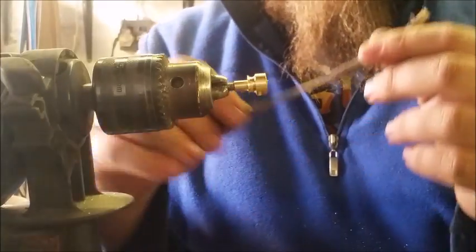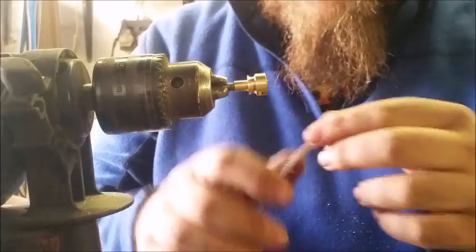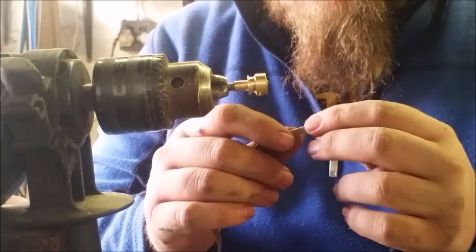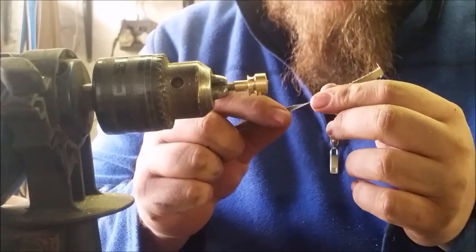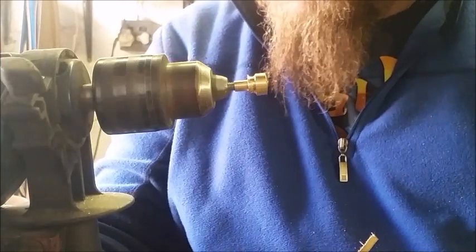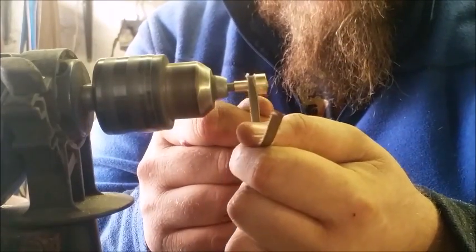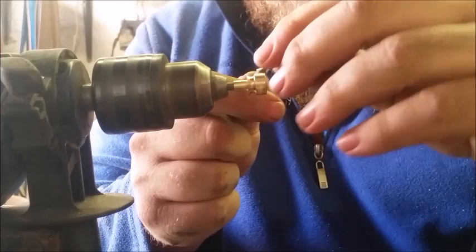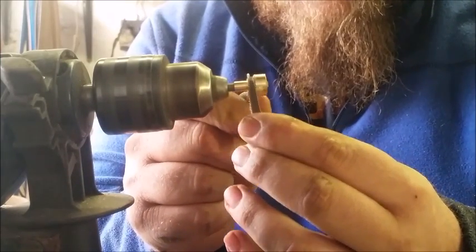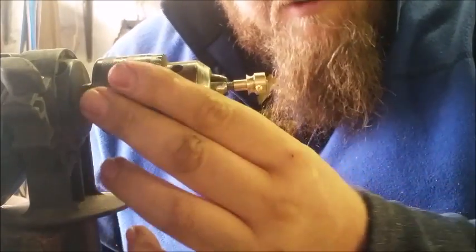Then I've got here a piece of old belt. Take any of the soft J-Flex belts that you might have. You can tear off a thin strip from it. Don't throw them away, always keep them, they're always useful. The reason we like using the J-Flex is because they've got soft backings. And now we polish on the inside there. It really doesn't take much.